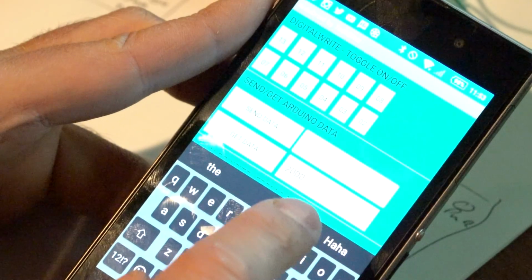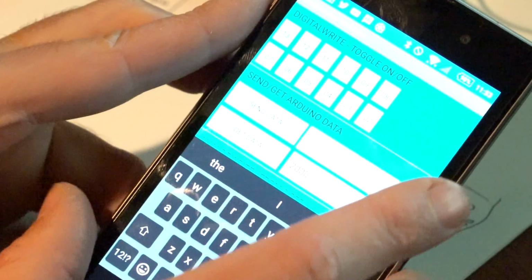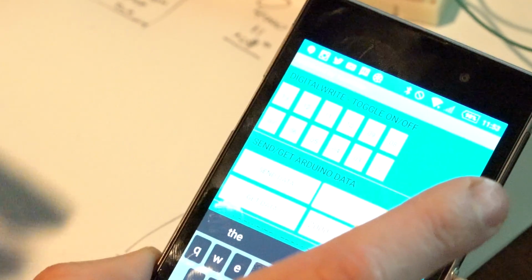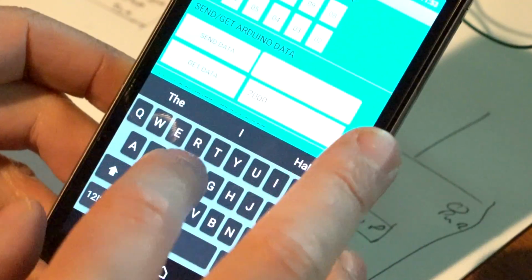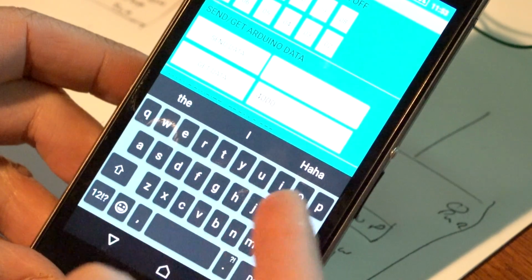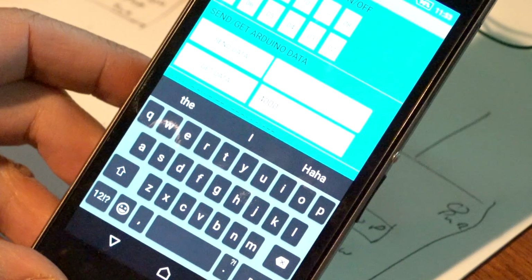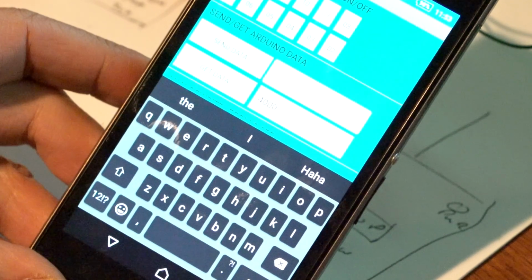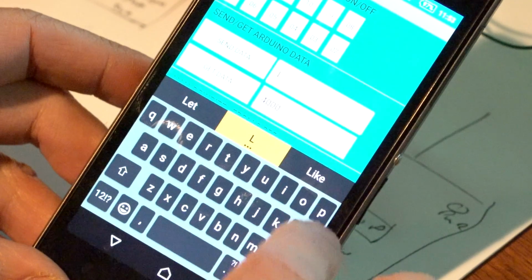Okay, so nothing happened with the motor, but it came back 2000. So the Arduino thinks that it moved it 2000 because it reports back with where its position is. So if we did an R again, it'll move it 2000, it'll come back 4000. Yeah, there you go. And if we send L, it should come back 2000 because it's gone counterclockwise 2000. And it worked.